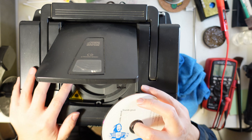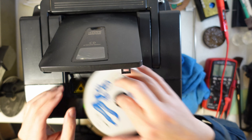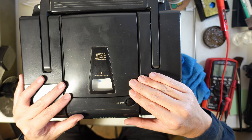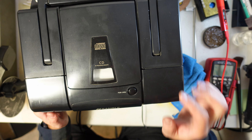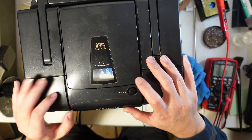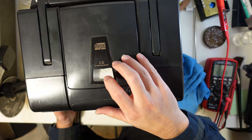There's one thing that never worked for me: tweaking the laser potentiometers. That's why I always replace the pickups. But on this boombox, when I put a good surface disc inside, it will give it a little spin sometimes. So I might have some kind of hope about this CD player. As you can see, it started rotating, but it only does that from time to time. Let's try to tweak the pot and see if we can do anything to it. It looks like it's trying more and more as time goes by, so we might have some hope here.